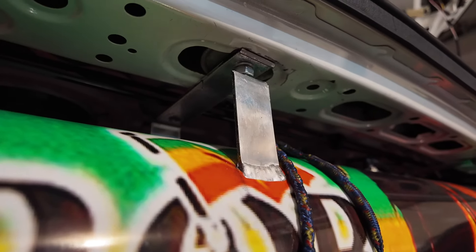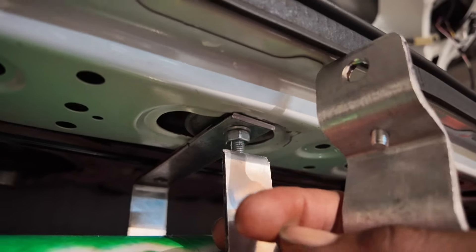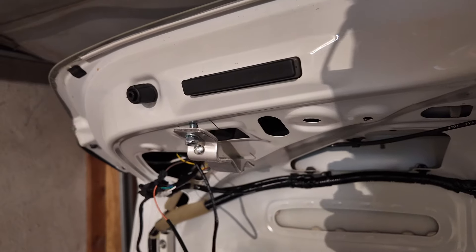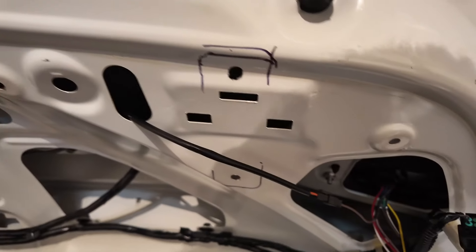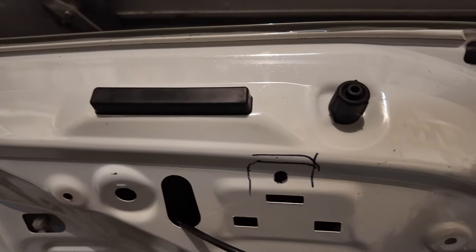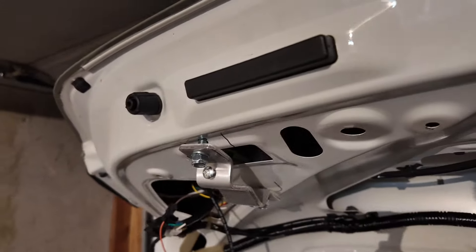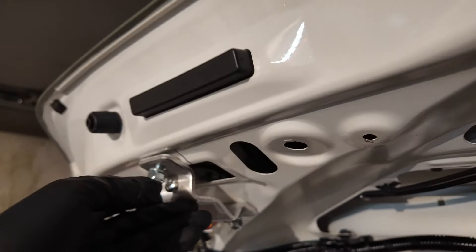The way I did this before — you see the hole, and then same thing: nut, bolt, and lock washer. So it's going to be the same, essentially, just up there. That took like literally two minutes to do, but you see — drill the holes. If you have an extension, the cord does go off of this. So let's drill it there. Just line up your brackets. If you've got this seamless tank, obviously if you're trying to hang one of these, you're going to have to measure that on there. So basically like this — I got a locking washer and I got locking nuts. So basically like that.